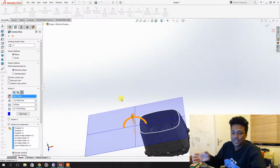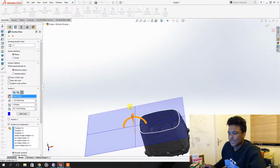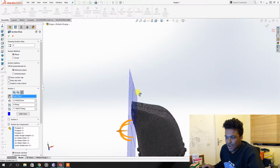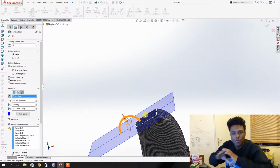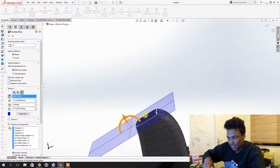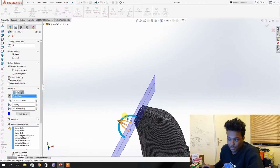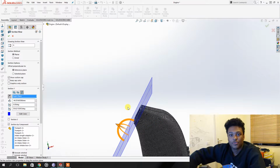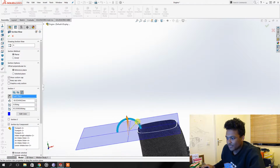The big benefit of that is, let me start over, the way airflow and energy work is that nothing loses energy. Energy only transmits from one form to another. So if you have a very high airflow that has a lot of energy as velocity, it will lack energy in pressure. But if you take that velocity away by opening the area out, so the air has a bigger area to flow through, that energy will be translated into pressure instead of velocity. Because the area becomes way bigger, the air has a lot more space to flow through, the velocity will drop, and therefore the pressure will increase, if that makes sense. I think that's the best explanation I've given so far.